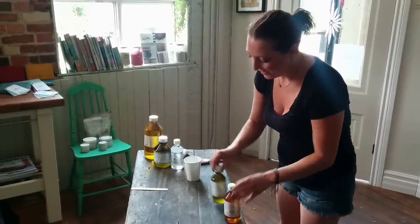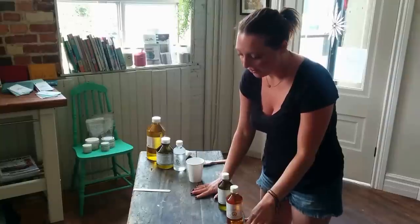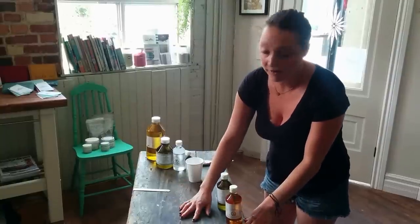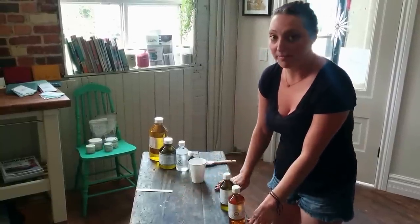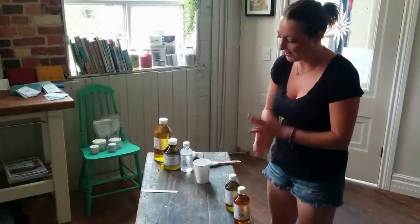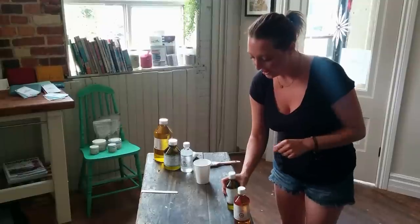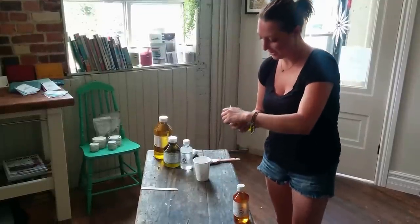So what you want to do is with a little prep work, see which kind of surface you're working on. This surface is a really old wood that's been weathered. What I could do is take a little bit of sandpaper to it and remove any of the imperfections or excess, but otherwise I really just want to revive the look of this. So what I'm going to do on half of it is use hemp oil.